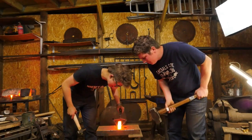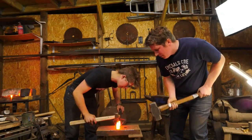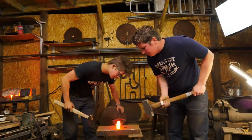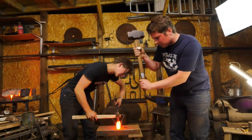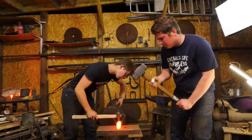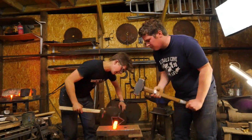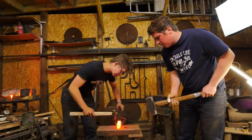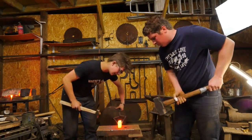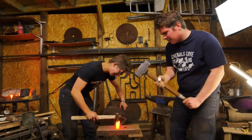Right. Did I put a punch bar? Yeah, I'm sure I did. I just want a medium one first. I'll wait to one side. I'm going to tilt my billet to go straight. For some reason, it's just 10 times easier to tilt the billet to put something straight than it is to tilt the punch. So if you can tilt your billet straight the whole way, I recommend it. Everybody puts that off center at first, but we're right in the middle now.